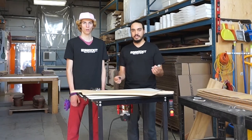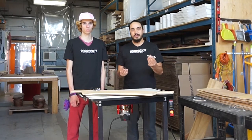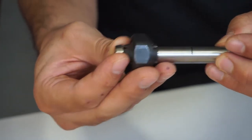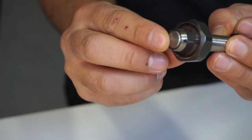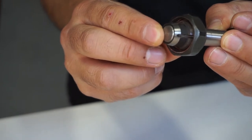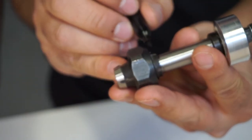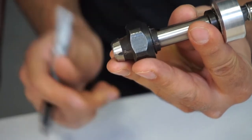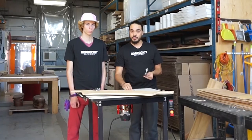So to put these together, you're going to want to make sure that, at the very least, your shank is level with the bottom of the collet as your minimum depth. If you want to help yourself out and register this for the future, you can always grab a Sharpie and just mark right at the neck of the collet, and this will show you where you can install this in future uses.